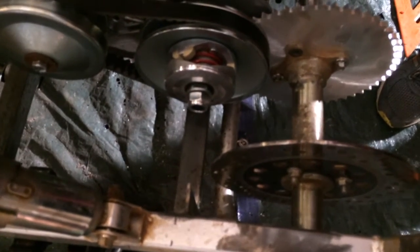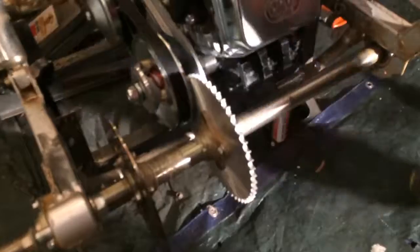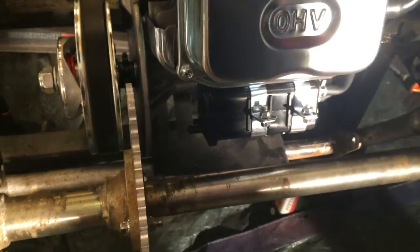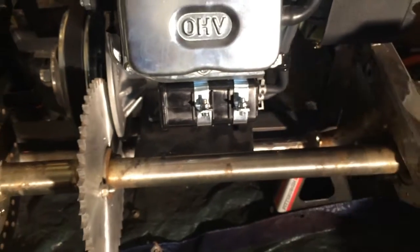I have pieces of angle iron that I've welded together. They go all the way across in the shape of a U, and that's what the engine sits on. Then there's a plate right here that has the same bolt pattern as what's on the bottom of the engine, so you can bolt your engine to that plate and then weld the plate directly to the brackets. You don't want to be welding to your engine because that's permanent — so this plate welds to those brackets. That's the mounting system I'm using.